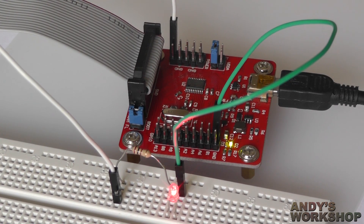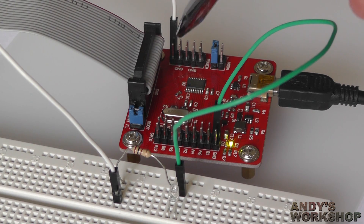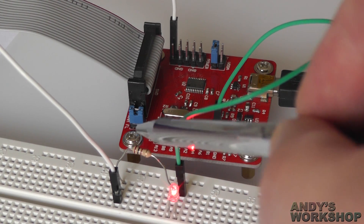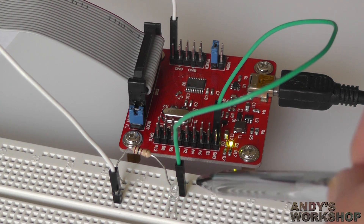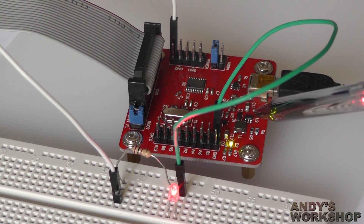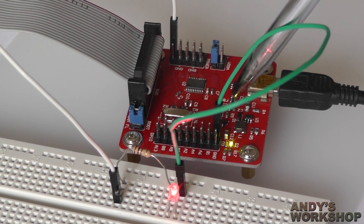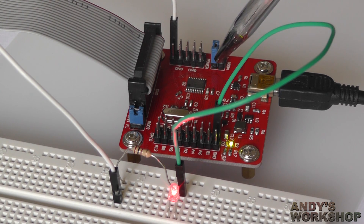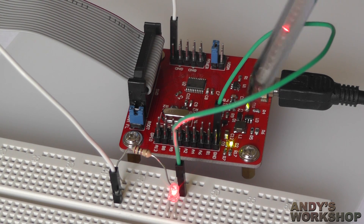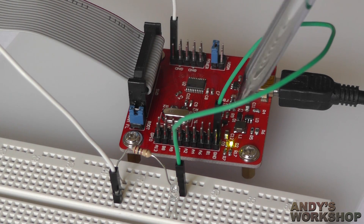Here's the board doing the classic blink test using the onboard transistor to provide switching for the one-hertz flashing LED. What we've got is 3.3V going through this wire, through a 100-ohm resistor, into the LED, out of the LED and into the LD load pin, which is connected on the board to the collector of the NPN transistor. In the MCU we're simply switching the base of the transistor on and off at one hertz through the PA7 GPIO pin, which results in the transistor switching and the LED flashing. This demonstrates how the onboard transistor can be used to switch a load without any external transistor setup.